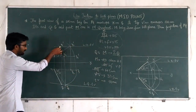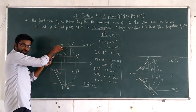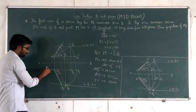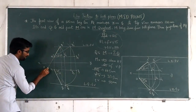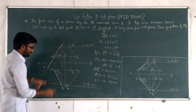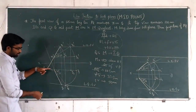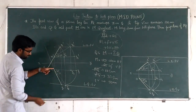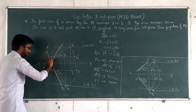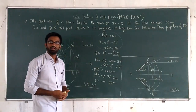In the front view, to get P, back-project along line M'Q' extended. M'Q' — using a compass centered at M', draw an arc to locate P'. Similarly in the top view, along line M2Q, back-project to get P using compass centered at M. P'-dash, M'-dash, Q'-dash is the front view of PQ. P-dash and P should be on the same straight line. This is how we solve the midpoint problem.